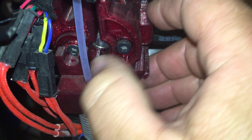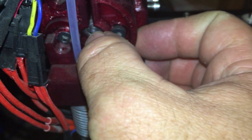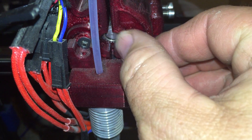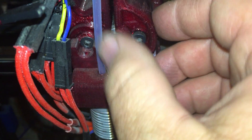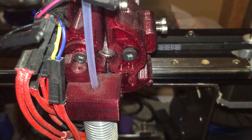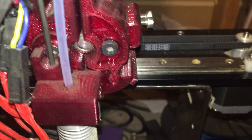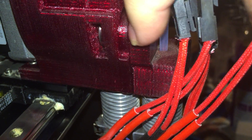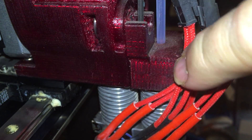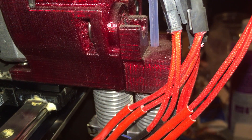These are bolts that are captured with a bearing on both sides. This one backs up the gear, which hopefully will help with durability on the inside of that extra stepper motor, and then this one backs up the filament. Right down in here, a little hole goes down to a bolt that is trapped in this piece right here, and goes into here with a nut in the hot end holder, and it can move up and down in the same kind of keyed slots.